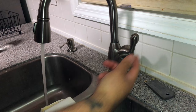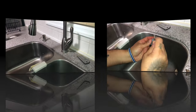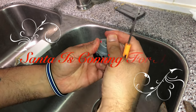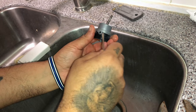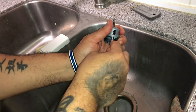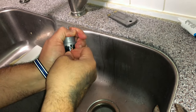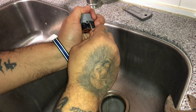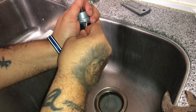As you can see it's quiet, no more noise, shuts off easy. Now if the valve is working but it's just making that grinding noise, you're going to come to the side of the valve. You have a clip here and a clip here — pop it open with a little screwdriver carefully. Work your flat blade screwdriver underneath and pry it up at the same time.